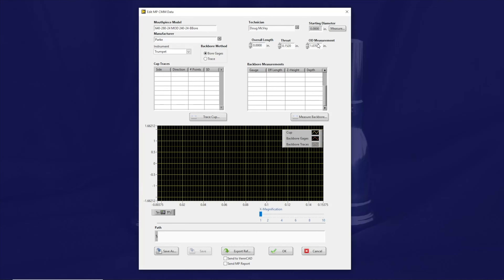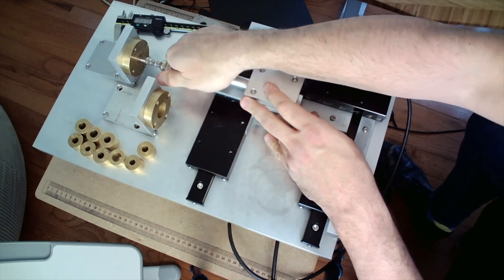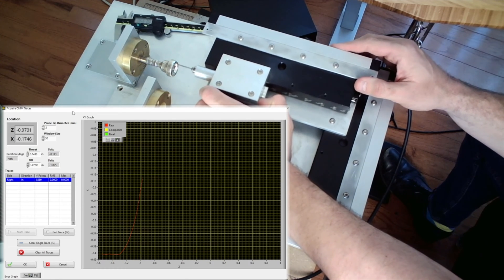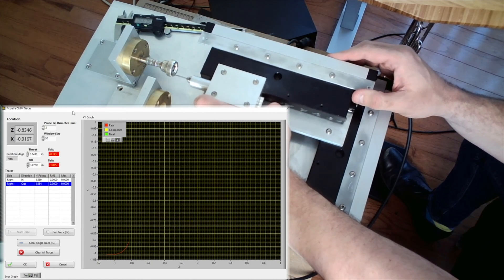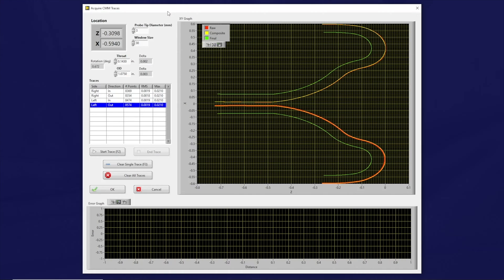After entering these measurements, we launch the cup tracing function. The mouthpiece is mounted in a precision bushing, which in turn is mounted on the machine. A foot switch allows for both hands to be free to trace the probe along the contours of the mouthpiece. Two optical linear encoders track the progress of the probe head, which is displayed on the screen. Four passes are made — one each into and out of the mouthpiece from each side. Each trace gathers over 8,000 points of data, for a total of 32,000 data points collected in just this short time interval. The red trace represents the path measured by the machine, and the green trace shows the contours of the mouthpiece itself, after accounting for the offset of the probe head from the surface. Further smoothing and averaging accounts for scratches, imperfections, and any bend in the shank.